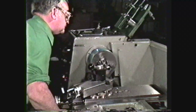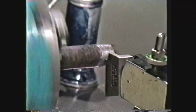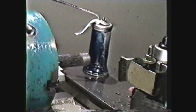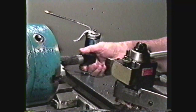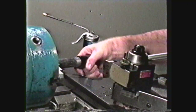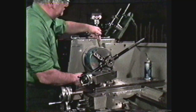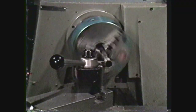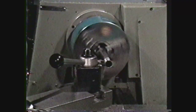This videotape will demonstrate how to machine or chase tapered pipe threads. A tapered pipe thread permits a tighter connection than would be possible with a straight thread. As with other thread forms, tapered pipe threads have a standardized system: the American Standard taper pipe thread series. For a rougher thread finish, the tapered pipe thread can be chased with a die; for a finer thread finish, the thread should be machined on the lathe.